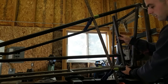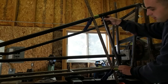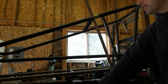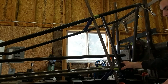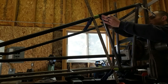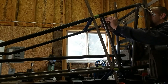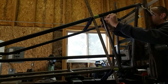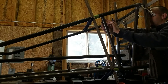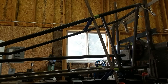From there we go into finding the angle and rotation of the second notch. If you place the tube back where the overall area is bigger, you can slide it up until it touches at the top, get your notch down here to fit as intended. For the rotation of the second notch, place this in where you want it, located with minimal gap. If you can get to the backside of the tube, as long as you put this on the center line of the existing tube, it allows you to mark the rotation of the second notch. You can use a Sharpie or paint pen — basically find the center line of the existing tube and transfer that down to the tube you're putting in, ensuring the notch is on the correct axis.